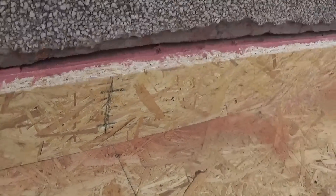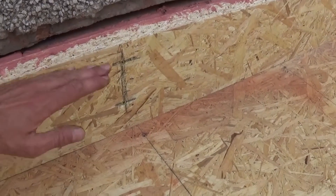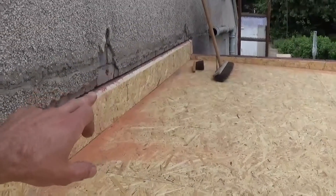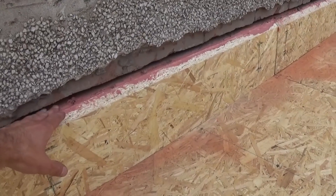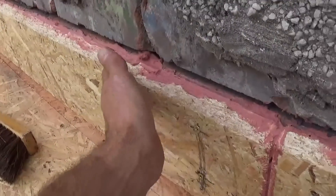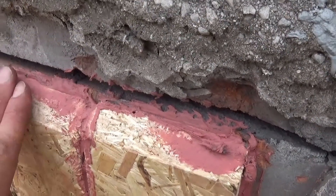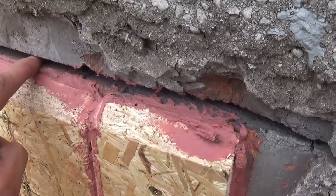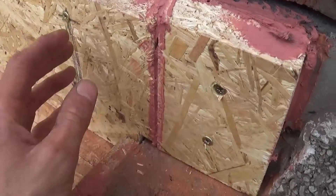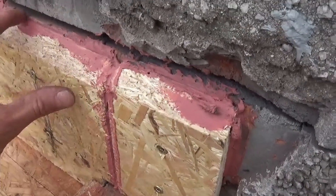We'll curve the rubber up there. We're going to put a stop bead across there, which we'll screw in with some sealant, and that'll create a nice sealed edge. But for extra precaution, I've ground a hole all the way along there through the cement line, and I'm going to put some lead flashing in there, which will eventually curve over the top and drain onto the rubber roof. Where we've turned the boards up, we've cut them to size and tapered the edge so the rubber can go up there nicely. Behind there we've used a masonry drill bit with plastic plugs, and pink grip behind the board to give it extra adhesion.